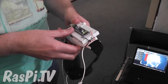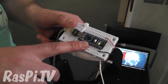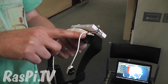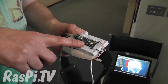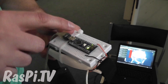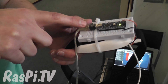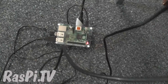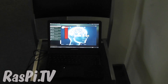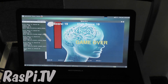Somebody far more exciting than me figured out how to get an Arduino to decode it. If you just search for 'Mindflex Arduino hack', you'll find a page that explains all about the Mindflex, the board that's on it, how to solder in the two wires required, and it also gives you the Arduino code to get the data out. The Arduino decodes the raw data from the Mindflex, converts it into a string, which is then sent serially down a cable — a big long wire today — all the way to the Raspberry Pi. That's a Pi 2, coded with Python and PyGame to play a version of Flappy Birds.